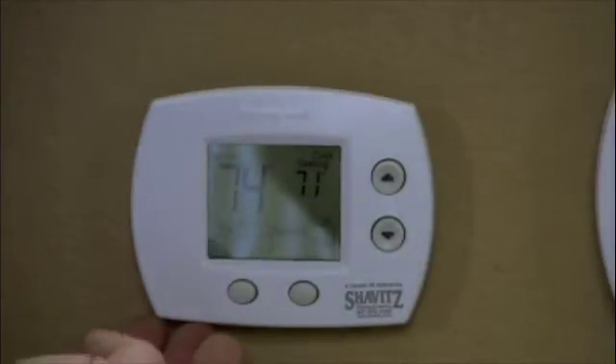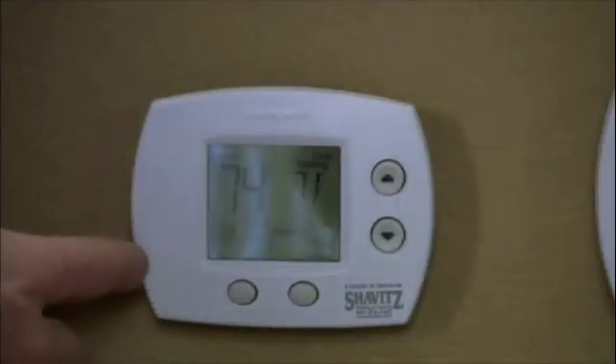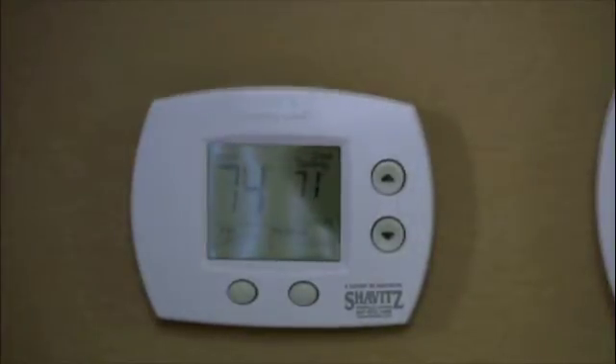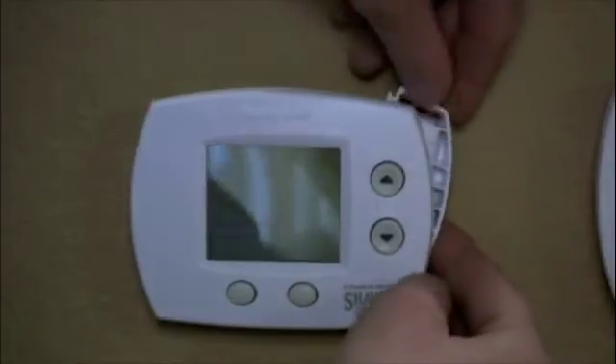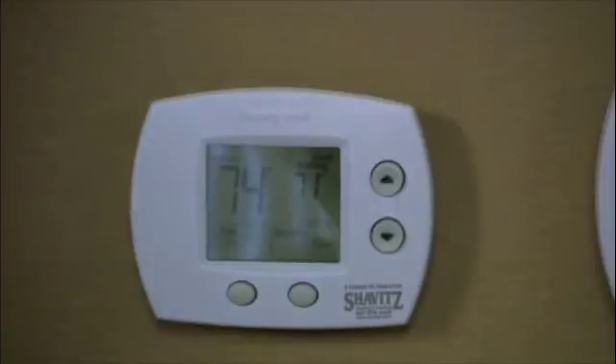So as you can see, this is a nice easy-to-operate thermostat. These thermostats are battery operated, and the batteries are just as easy to change. There's a button on the top that says press — all you do is press this button and the battery pack slides out. It takes two AAA batteries. Change out your batteries, put the new batteries in the same way it came out, and put it back in. Nice easy-to-use thermostat — set it and forget it, easy to read, easy to use.